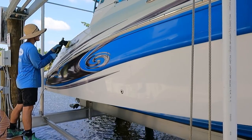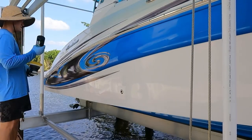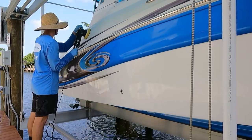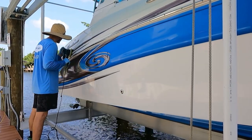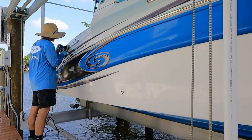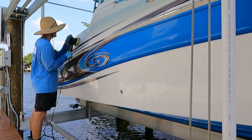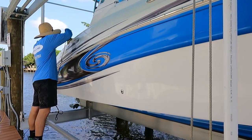If we go with something too soft the pad is going to break down, become super squishy, and it's going to be very hard to apply the wax. If we go with something too hard then the wax is not going to be able to absorb into the pad and we won't get a good even application. So it's really important to get something medium — the 5-inch medium LHR15 pad has been one of my favorite go-to's for applying wax on a boat.